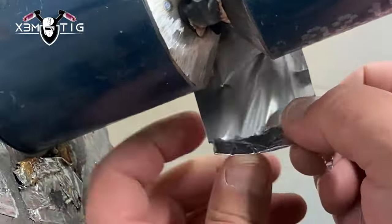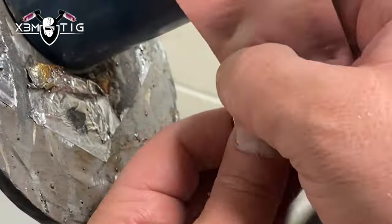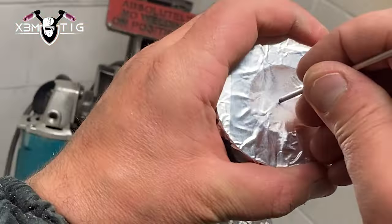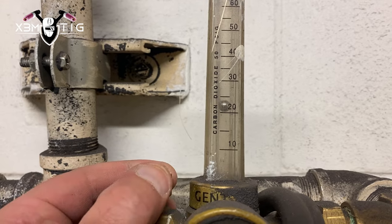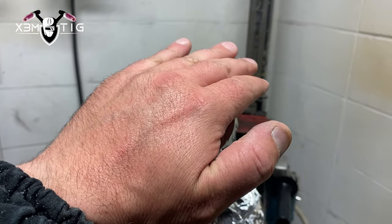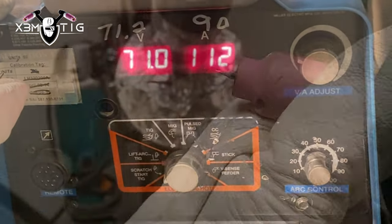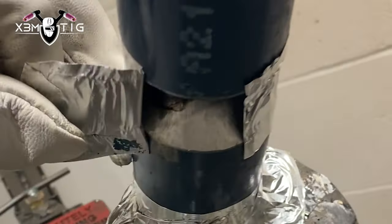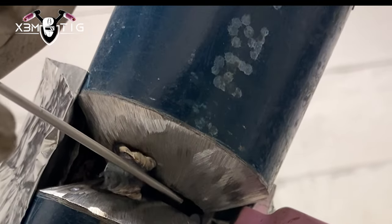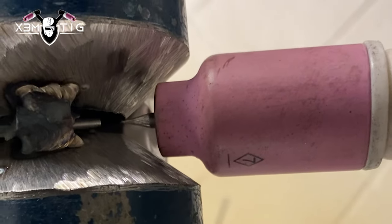Try to keep the rod in that puddle. Inconel refers to a group of specific nickel-chromium alloys used in different welding processes. It's a little bit difficult to manipulate the puddle — it's like lots of impurity inside. For the purge I'm gonna go up to 30 CFH, just leave it to have nice good coverage. It could be difficult because the welds have a tendency to crack — I'll show you later how you get impurities on top of your weld and it's a little bit difficult to stretch.